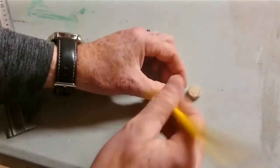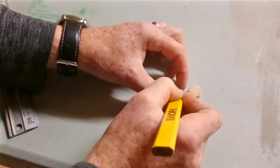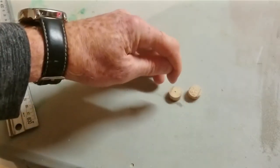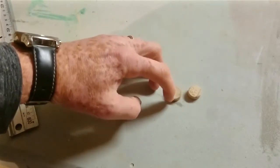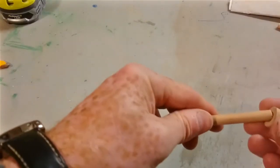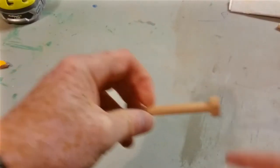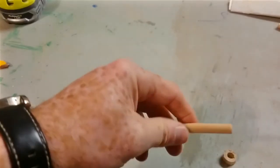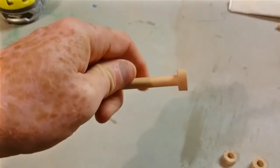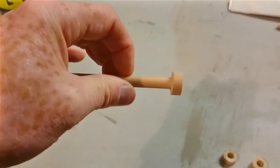After you've cut them, mark a hole in the centre — you should be able to guess the centre pretty well. Put a little mark in the centre on both, then get a very small drill and drill a pilot hole first, then drill your 8mm hole through afterwards. That way it won't grab so much and it'll stay in the middle. The piece should just slip over the top and be pretty square. Don't feel bad if you make a mistake — the first one I made was horrible and crooked, so it went in the bin. Just take your time and have a few goes if you need to.